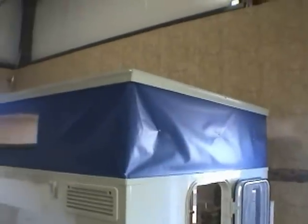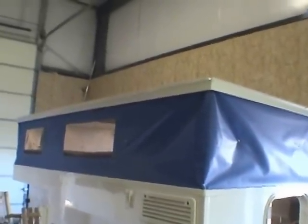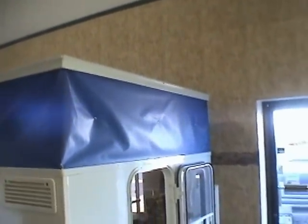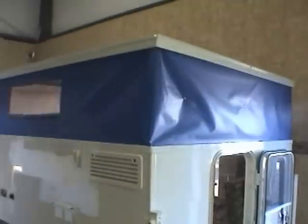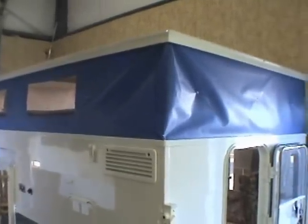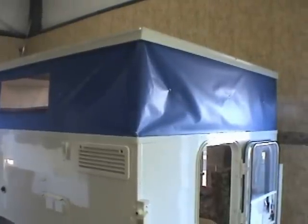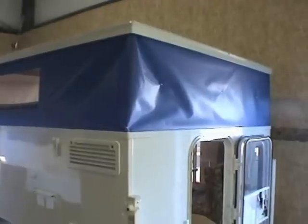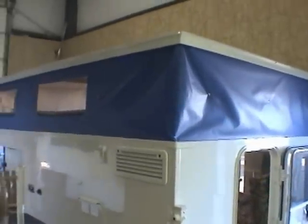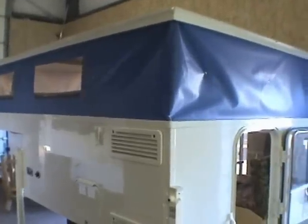The roof is an aluminum frame roof, made the same way, vacuum bonded. You could walk anywhere you wanted up on that roof. It's really strong, really lightweight. The softwall we use is a Weblon softwall, which is an 18-ounce fabric that's extremely strong. It has webbing inside, doesn't change in any temperature. It folds really well. It lasts and lasts. I've never had to replace the softwall because it ever wore out.